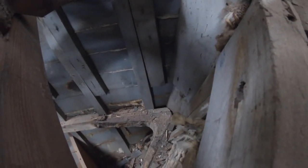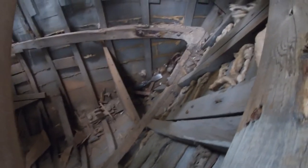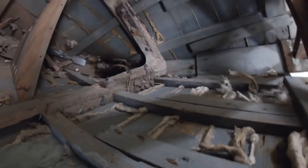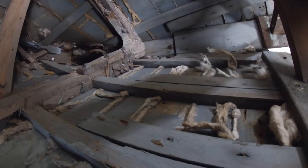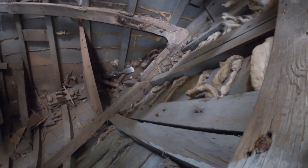You can see that iron V-thing down there. That iron is definitely causing a problem — you can see where there's some iron sickness, where the iron will actually react with the tannins in the white oak. I've got to get that pulled off because that is probably a spot where I'm gonna have to do some repair.